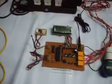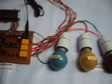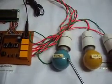The temperature sensor and the water heater are interconnected. If the humidity sensor senses that humidity — which is measured in terms of relative humidity — goes below 70 percent, it should automatically switch on a water heater. The water heater temperature should also be maintained at 45 degrees centigrade. If the water heater temperature goes above 45 degrees centigrade, as measured by the temperature sensor, then automatically the water heater should get switched off.